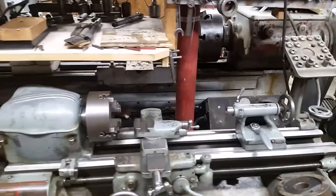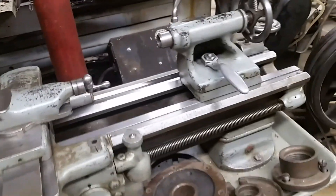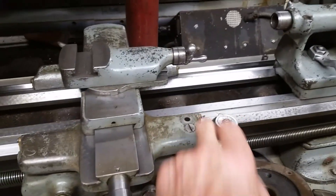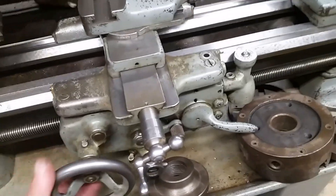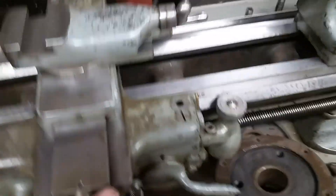We're back after a couple of minutes of thinking and I'm taking a little detour. This is a South Bend Precision Model A nine inch, and what I found when I cleaned it really thoroughly yesterday is that the lock is missing for the carriage. If anybody knows where I can buy that lock or the dimensions, that would help. Also, I'm wondering if something is missing on this side - the back side should have a bar on it to keep it from lifting up but I don't see one.